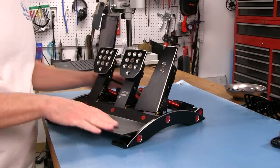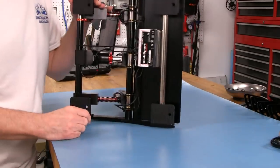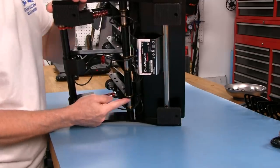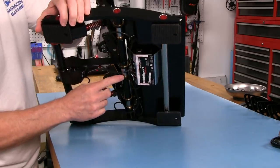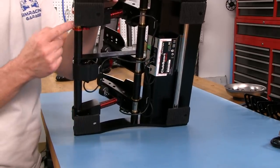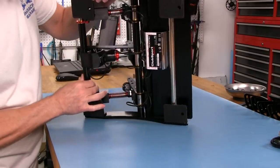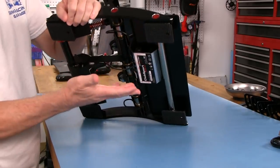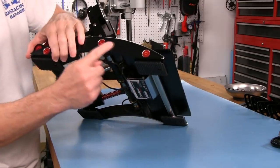The reason for the weight becomes apparent when you turn it upside down. We've got bars making up the frame, a solid steel rod here and another solid steel rod at the front of the pedal mounts. On the bottom, the pedal mounts have bronze bushings all the way around, very nice. We have the same thing continuing on the bottom. There's also a steel square bar acting as a stop and reinforcement for the frame, pinched in between the frame - the pedals land on it when they return.